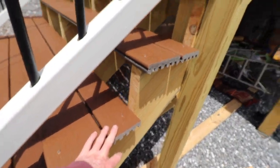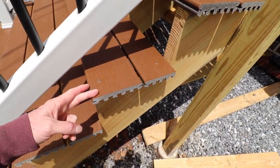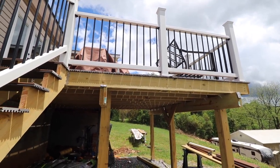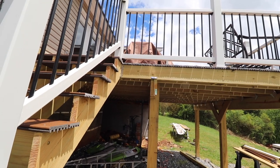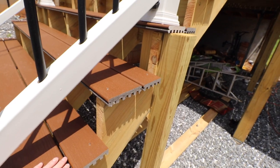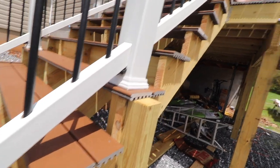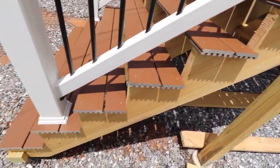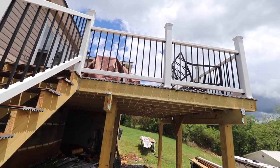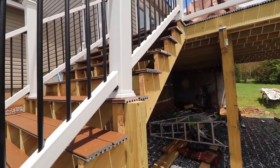You can picture-frame decking, but I didn't do that here. I basically cut everything in place, including this side — I was able to get up there with a saw. Trex cuts really nicely; it's fairly flimsy material when you're working with long pieces, but once installed, cutting and screwing go in really nice. I lined up the far side when I installed it.